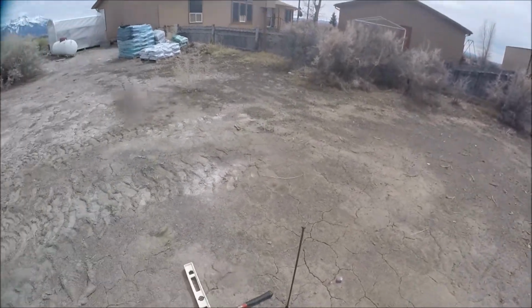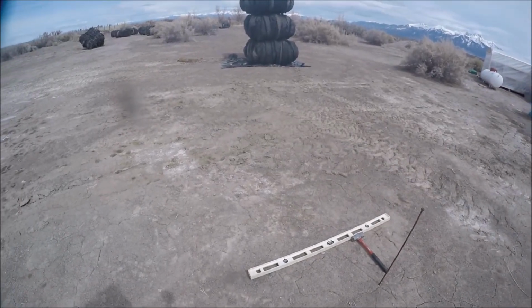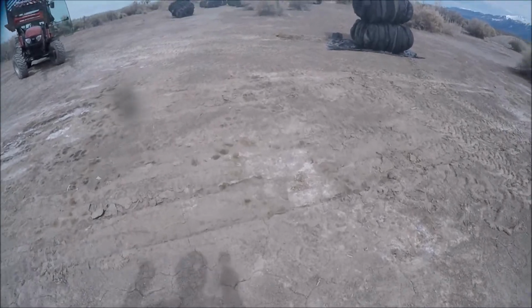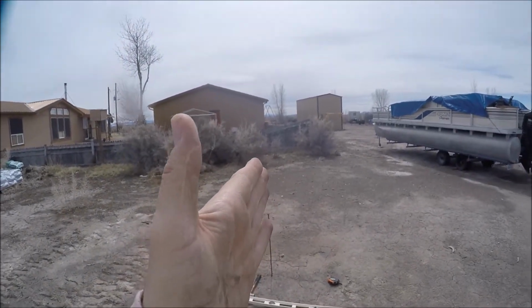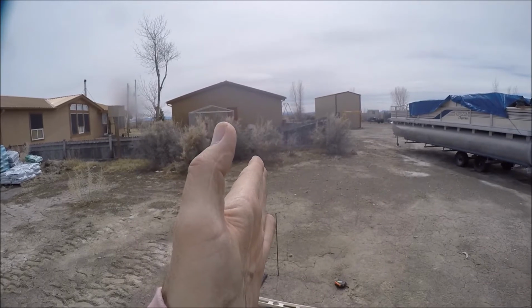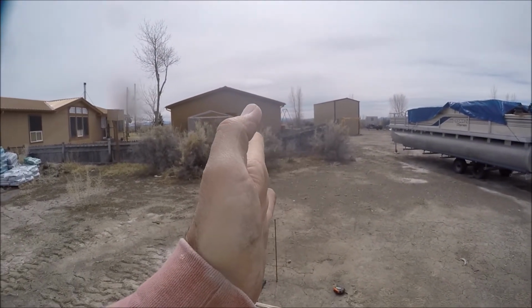I'm probably not even using a compass because I don't care much about magnetic south. Now, as far as the older Earthships go, in the older Earthship book that Mike Reynolds wrote from the 90s, they would orient the homes not true south, not magnetic south, but 10 to 15 degrees east of true south. So if true south is 180, maybe 170, 165.